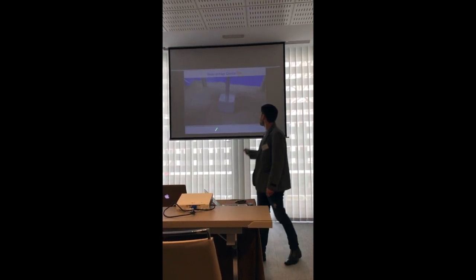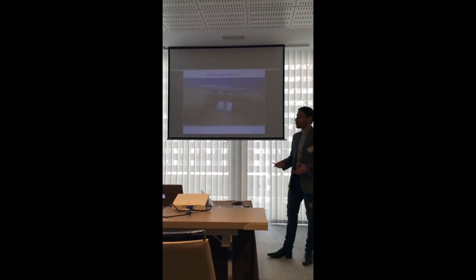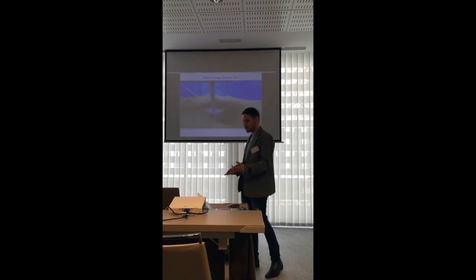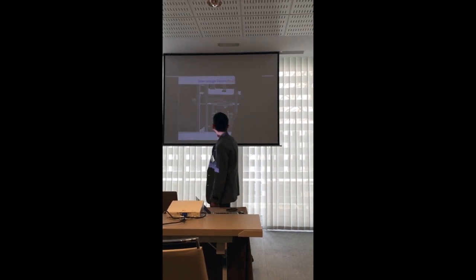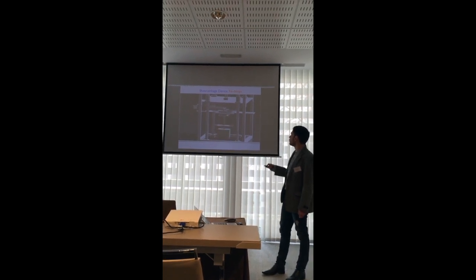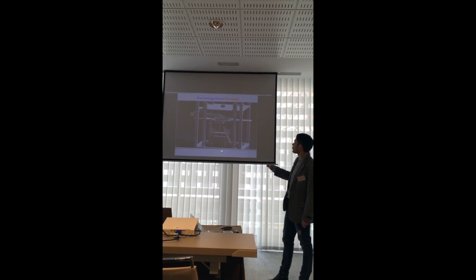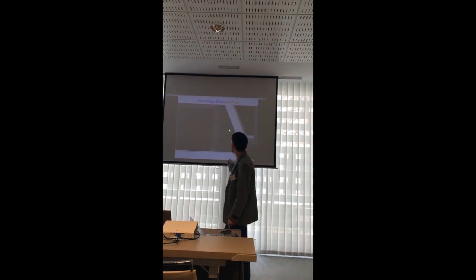This is some testing of the shear box. The shear box is just 5×5×5 centimeters. Here we have video of the test of the shear box without the clearing flaps, and also the improvements on the design — this is what's going to be actually on the rover: the shear box, clearing flaps with actuators instead of the typical triggers, and horizontal actuators with more load cells for better accuracy with respect to the parameters.